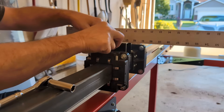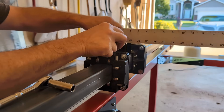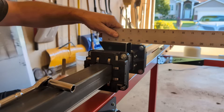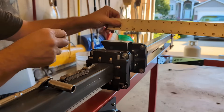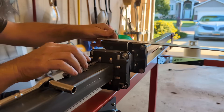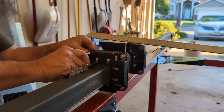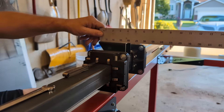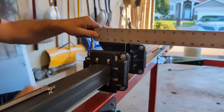I'm rocking it into place. I got a little better — the smallest feeler gauge still comes through, but there's a little burr back here. I'm moving the gauge and it's tiny — I'm getting a lot more level. I'm going to set this down, give it a little bit of a rock, and look at that — tight, doesn't fit in anywhere. Got it perfect. I'm snugging these up. Take a look — it looks pretty good. Just a tiny bit right there but I think we're going to call that good enough.